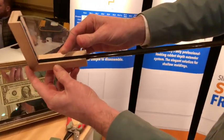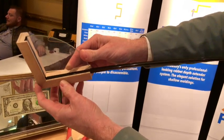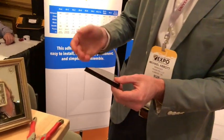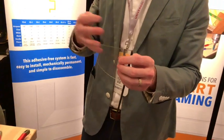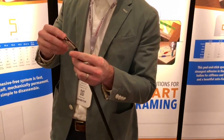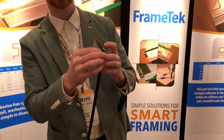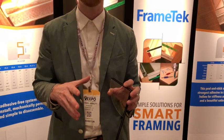What you're going to end up with is a nice butt joint, but it's going to look mitered the way it's put together. Benefits — let's say my glass breaks or something changes. I can just pop these spacers right off, do any maintenance I need to, replace any glass, and reinstall very easily. The other selling point is that by having the edge of your glass protected, you can put these into metal frames with ease and not worry about chipping or breaking your glass pieces.